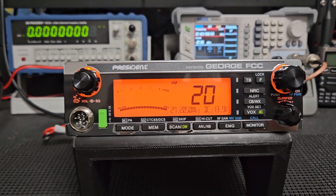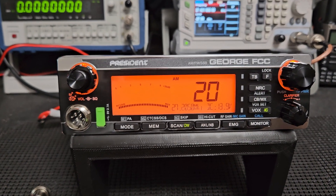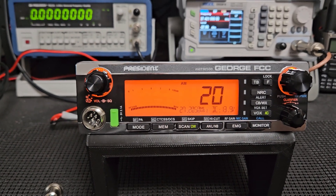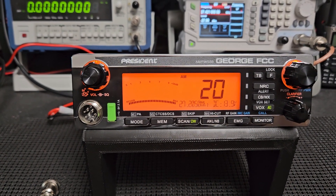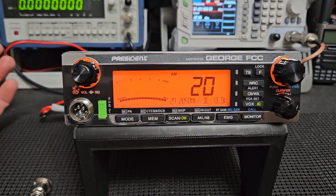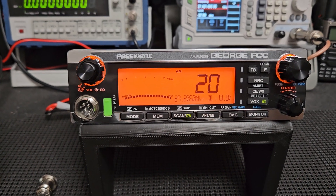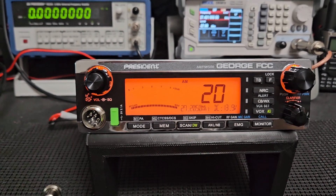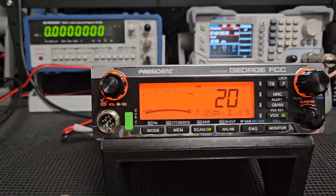The last point is: when you do turn the radio all the way down, people on the same channel will still tell you that you sound good — because of whatever they've done with these modern boards in these radios and other 10-meter models. They still sound intelligible running like that. But that still isn't a reason to do it, because why would you want to waste your power and spread it out beyond where it should be?